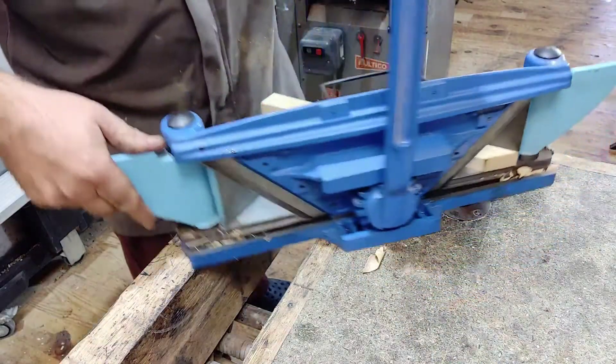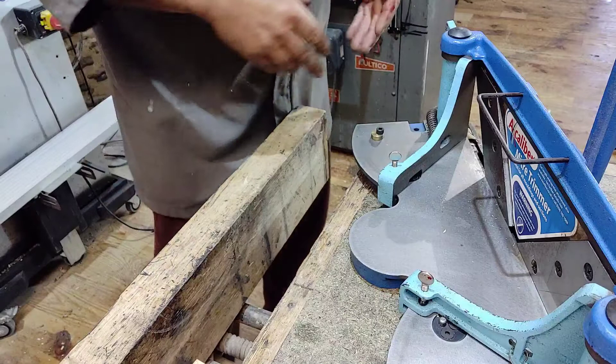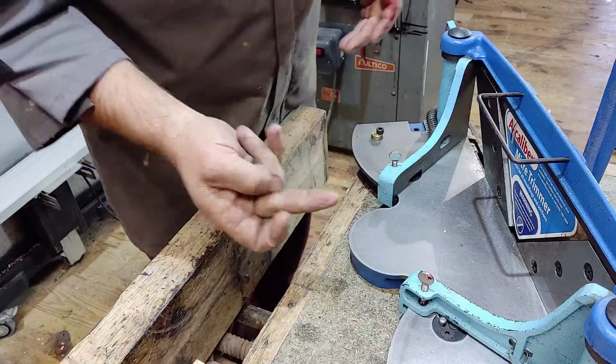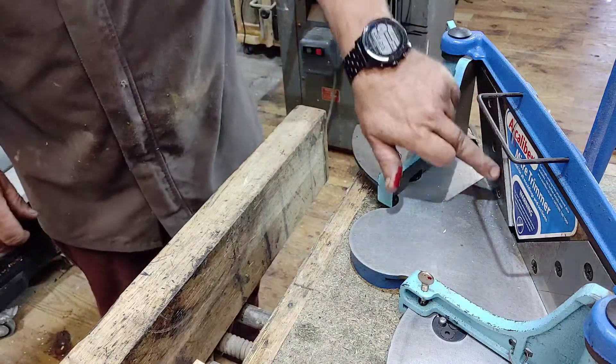They're quite easy to set up. You have to obviously make sure everything is kept tight. The other thing is, because these have cast iron tops, if you don't use them very often, put a bit of a coat of oil on them just so they don't rust on you and end up with rusty surfaces and pitting like I did on the actual knives. Anyway, that is my little video on how I set up my Axminster MT1 mitre trimmer — the same as the Rockler and also the Grizzly. While you're here, if you'd be so kind, click like and subscribe, and maybe the little bell icon, because then you'll know when I upload another video. Thank you for watching.